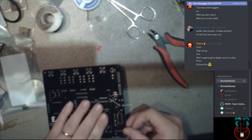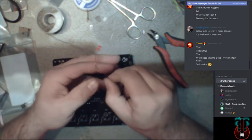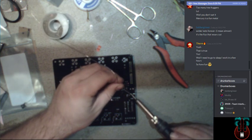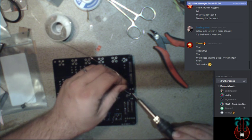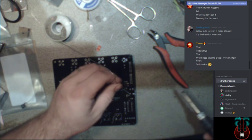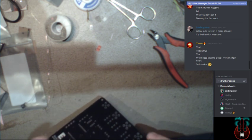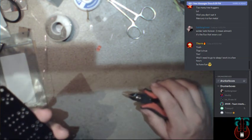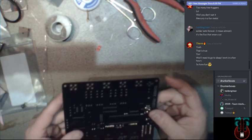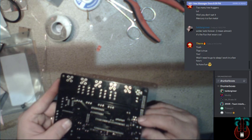So the ATtiny85 chip provides 2 timers and counters, timer counter 0 and timer counter 1. Each of these provides 2 PWM comparators. So in theory, you should be able to get 4 PWM outputs. But I didn't think the fourth one was connected to anything. You might be able to do a hack using Charlieplexing or multiplexing. Well, I wonder if you could actually interrupt it and change the compare register. Fortunately, the solution is fairly simple. We define an interrupt to occur when register OCR1A matches timer counter 1, and another interrupt to occur when the counter overflows, reaches 0 again, using the TIMSK register.